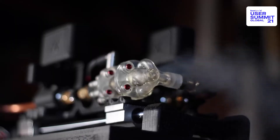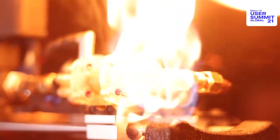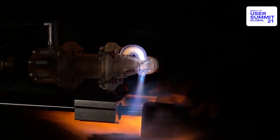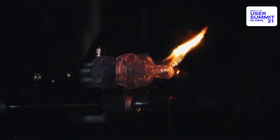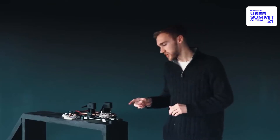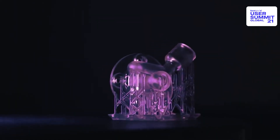As with any material, when it gets very cold it becomes brittle. When flowing liquid propane through the nozzle it caused this brittleness, so on a hard start it shattered the nozzle again. A new nozzle later and we got the best firing yet. A clear supersonic Mach diamond pattern is present in the exhaust. The inner chamber wall has no heat damage because of that shield of swirling oxygen — only the nozzle throat erodes due to the extremely high temperature it's under. In a metal version of this igniter, just the throat would require some regenerative cooling channels to keep it from melting. The transparency of these parts is what makes it a brilliant demonstrator because you can see the combustion taking place inside the chamber. All of these tests are made possible by the fact that the Form 3 is printing in resin, so it's able to withstand higher temperatures and you can create really high fidelity orifices within the injector.